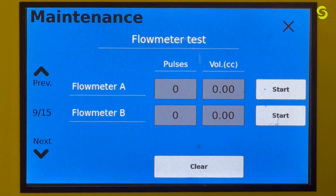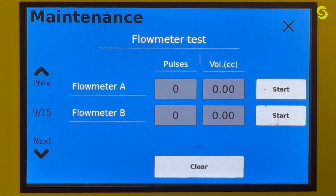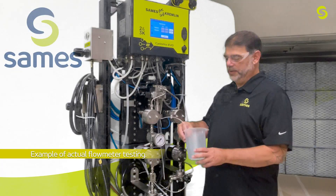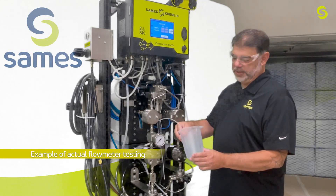Page nine is your flow meter test. This lets you run a quick test using the test valves on the mix manifold to verify ratios. You hold your beaker, start the machine, and take a measurement — if it reads 200 here and you also have 200 in your beaker, you're fine. If the readings differ, there's an issue and you need to check the flow meters. Now for the B side, take your B-side dispense hose and put it in the beaker.